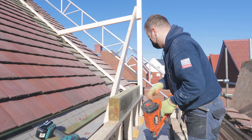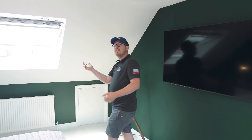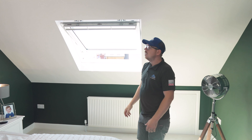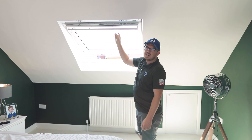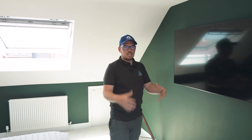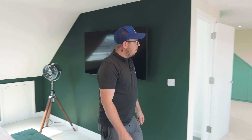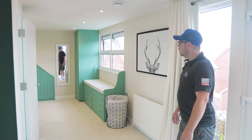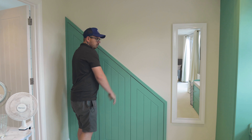Oh hello Patrick, nice of you to join us. Come in, mate — boiler service. And typically what goes wrong in these kind of boilers then? Is it the fans and stuff like that? I know we've changed a couple of gas valves lately. Yeah, gas valves more because they're making noise. These sump trays have a tendency of having a crack and leaking into the boiler, so you change the sump tray. And if it leaks there, does it leak outside of the boiler or would it end up going in the condense? No, that's why it's hidden — so no one would notice that their boiler is leaking because it's going out of the condense. You need a pressure drop constantly and that's when you get plumbers' headaches coming in. We're like, I can't find this leak — it's actually because it's internal. And every time we do a service we do a full strip down like what you're doing here. I appreciate it — it's a bit difficult to show this on camera. I'll jump out of your way, let you crack on, mate. We'll see you in a bit.